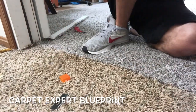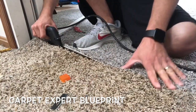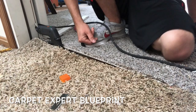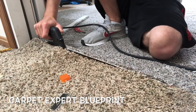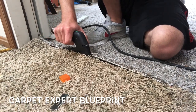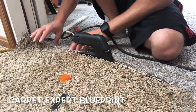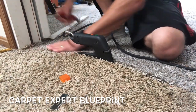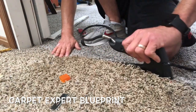I'm going to grab the seam iron. Drop the seam iron in there — this video is sped up just a little bit, but basically let the iron sit in one spot for 8 to 10 seconds. Slide it one iron's length forward. Put the back of the seam together. Give it a rough 8 to 10 seconds in the existing spot, then slide it one iron's length forward again. Tuck the sides to make sure everything stays nice and tight and secured.